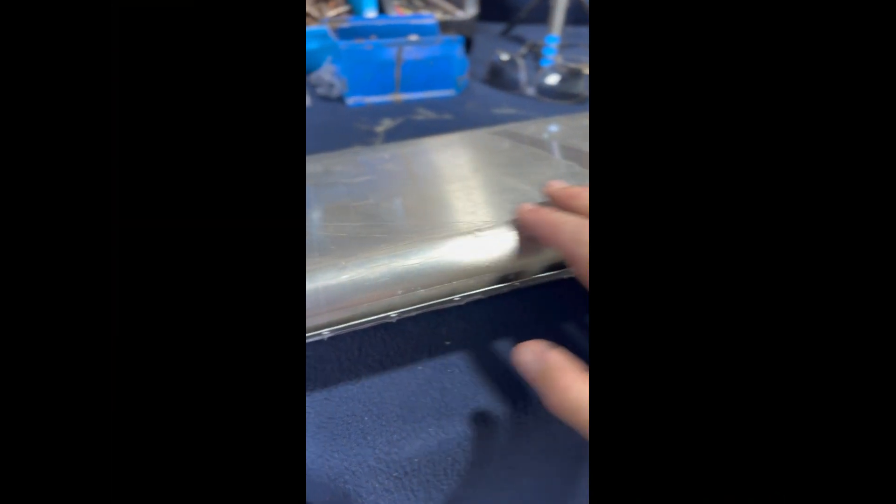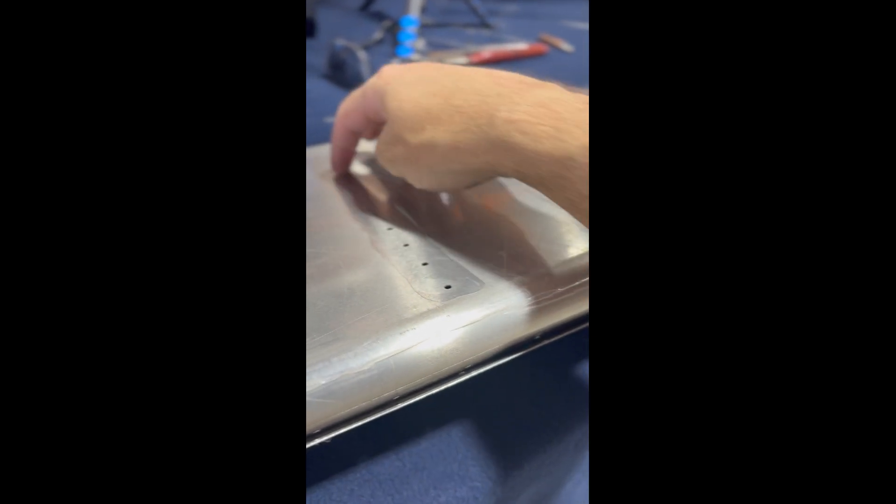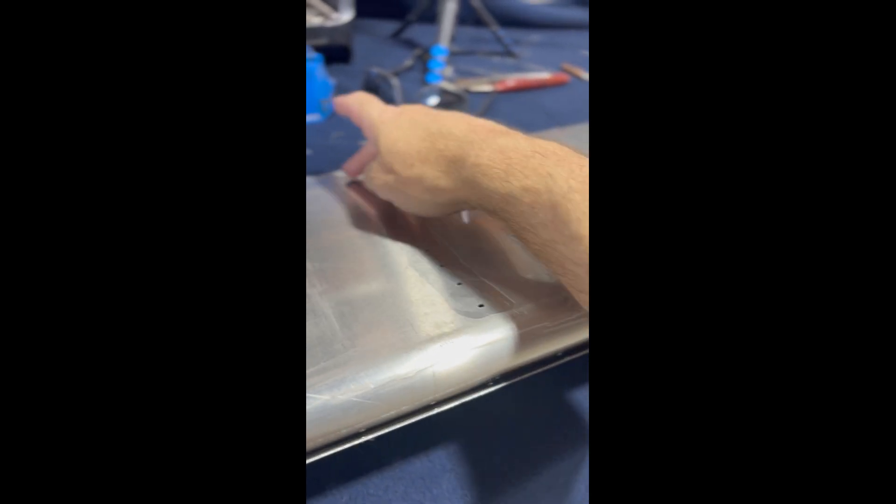Skin prep's going pretty well — using the soldering iron just to knock off the plastic where the rivets are going to be, so I can get that prepared. In underneath here it's an absolute nightmare — not much room to get in — I've got to take the whole lot out, scour the inside rivet lines, and prepare them with acetone. There's a lot of work in here that you think won't take long but just takes an hour or two — it all mounts up.